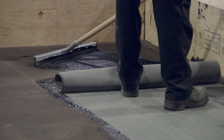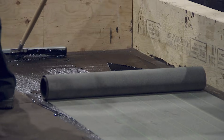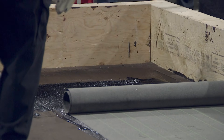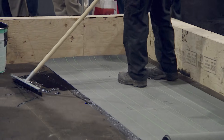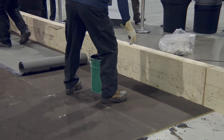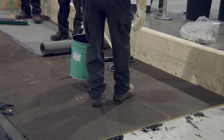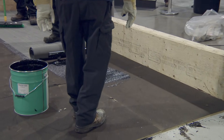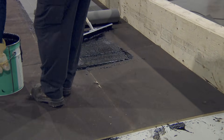There's an idea out there that what you can do to roofs is just keep recovering them. The problem is — why are you recovering them? Because it had a leak. Anytime water gets into your system, it's trapped in there — you lose all your R value, your insulation once saturated is no more, and the other problem is it rots, so you don't have proper adhesion and wind can blow it off. The only way I would recommend recovering is to do an infrared scan at night — it tells you where your wet areas are, you cut them out, replace them, and then you're fine. You also have to look at your weight and load capacity.